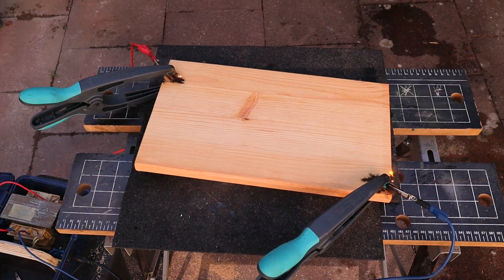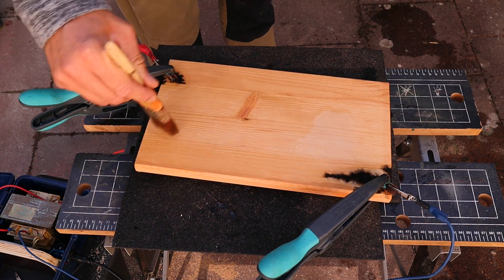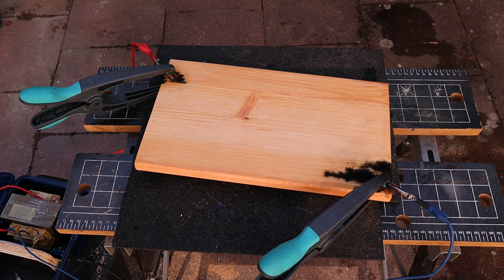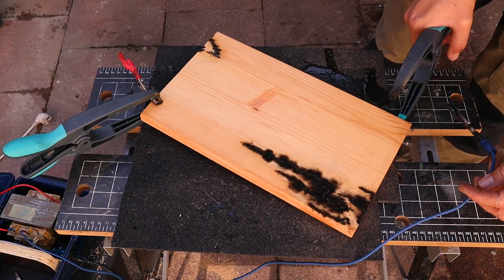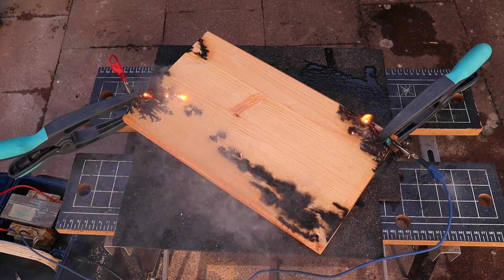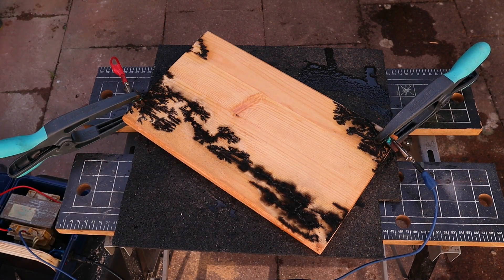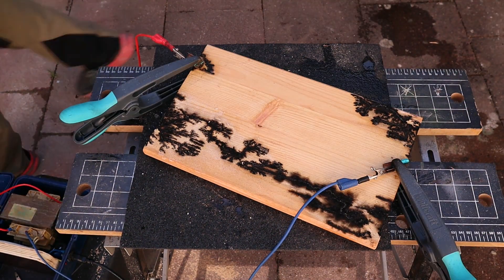The first piece of wood was beech wood and this one is now a piece of pine. What I found out is that it takes longer and the structure is very random, as the wood is. If you have a finer grain you get a finer kind of lightning figure. If it's a rough or glued-together piece of wood, the result is less predictable and the burn marks are much steeper — which is nice if you want to fill it with resin or so. In my experience, the harder the wood, the finer the results.